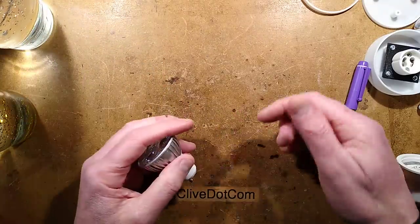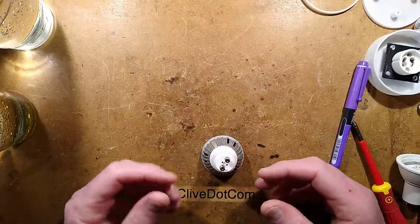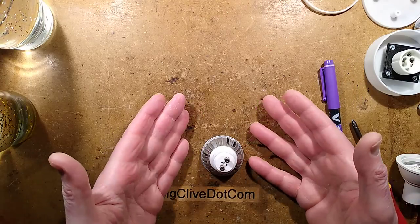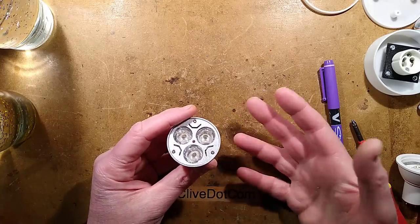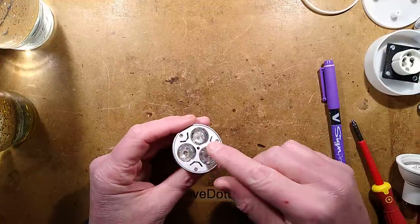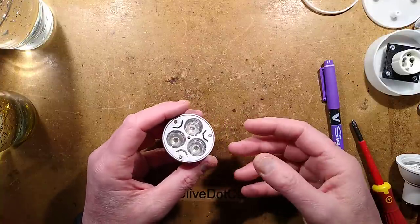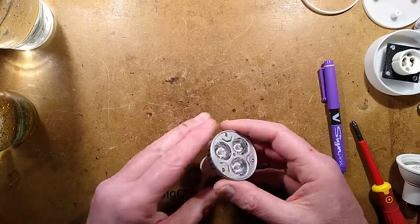That's how you can make your lamp. So if you go down below into the description, you will find those scripts. Just copy and paste them into OpenSCAD, change the variables to suit your own personal preferences, and it will create your STL file that you can then 3D print. Or alternatively, improvise and hack and modify an existing glitter lamp to the lower power, slower, more colourful variation. And remember, once you've made a 3D printed one with plastic, definitely don't stick in a standard tungsten lamp. Might be worth labelling it to make sure people don't put in a standard 50 watt GU10 lamp.